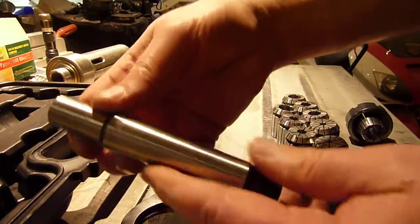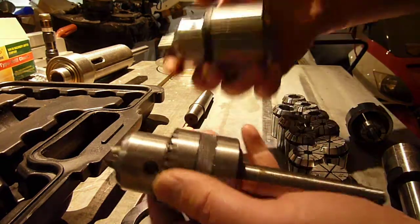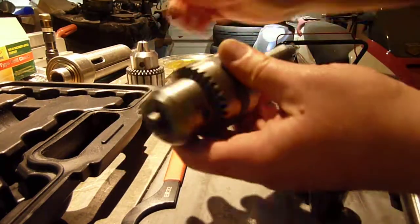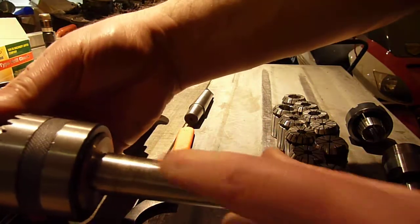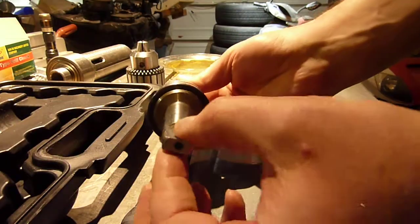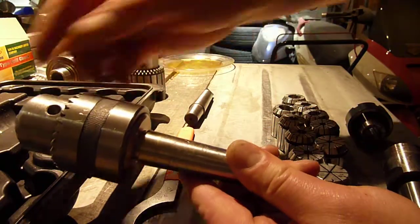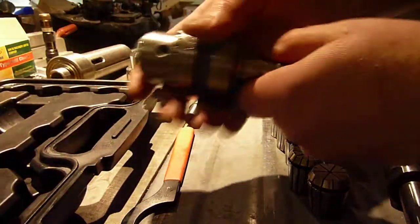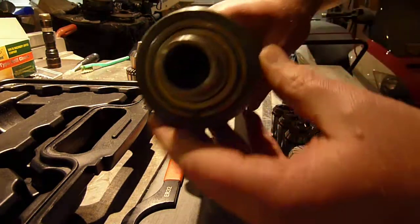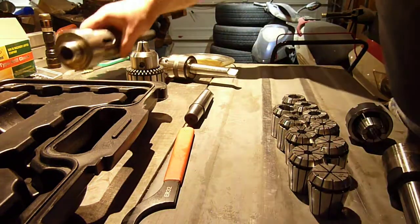Here's the new MT3 taper for it. The old drill chuck — this one's kind of a steamy pile of shit. As you can see, the new one's a fair bit bigger. The new drill chuck will go in the quill after a while. There is a little bit of rust and scoring on the taper, but the top of this flange part gets trapped in the top of the taper. So if you put it in wrong, it won't go in — you have to put it in right so that flat fits, which also means you don't get any twisting. You can't literally twist it out of the taper. There are a few marks on the taper but not much, and it's smooth. The taper inside the drill quill assembly is glassy smooth — there was just a little patina of rust at the very bottom, which a little scotch-brite cleaned up quite nicely.